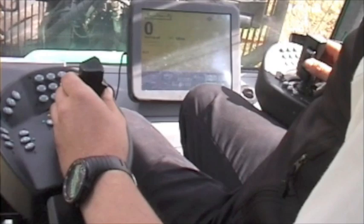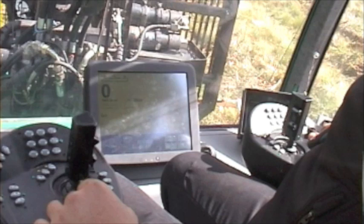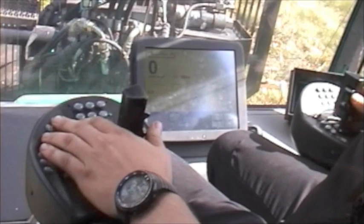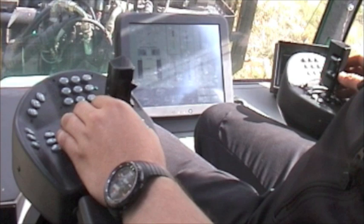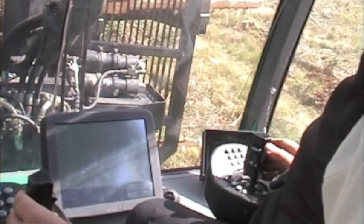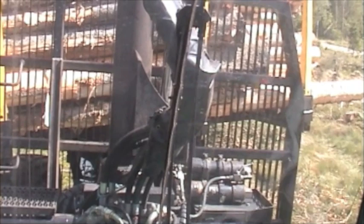What can you say about the controls? You are sitting with two joysticks here. I have a setup that essentially corresponds to a harvester's setup. I select three different modes. Right now we are in harvester mode where I operate the crane and aggregator just like a regular harvester. Then I can switch to a transport mode where I drive the machine forward and backward and can level it by inclination. And then I have a third mode where I drive my own machine — a regular forwarder in this mode that I can drive out to the landing and unload with.